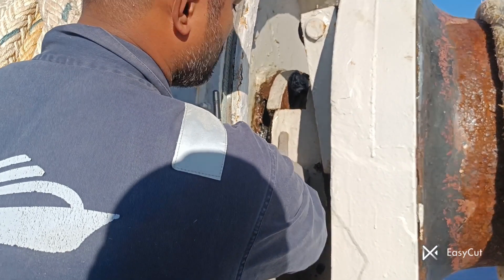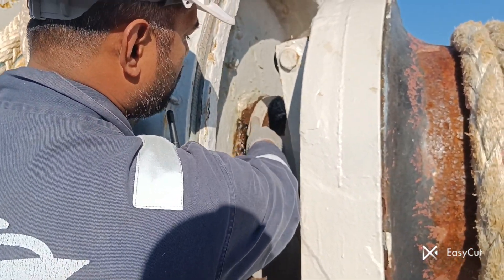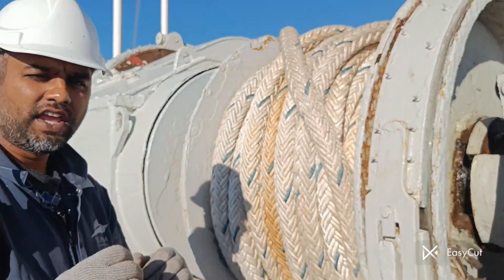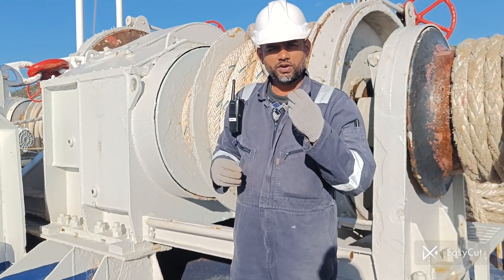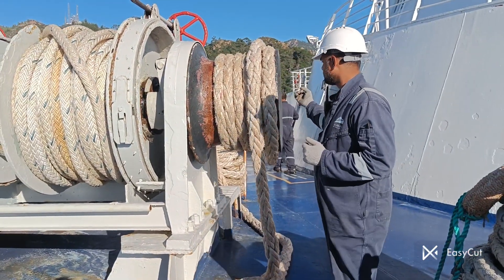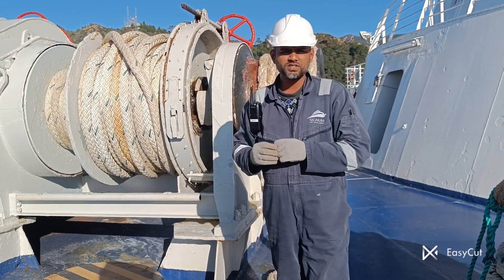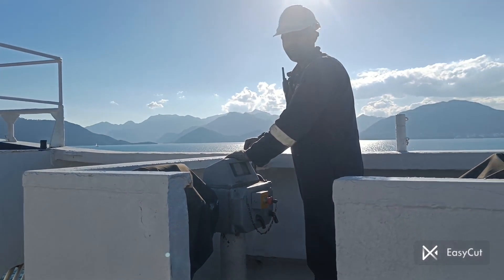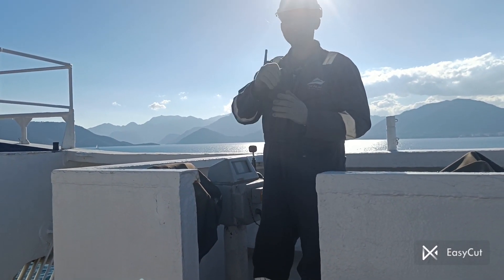This is the clutch for the mooring winch drum. We have two clutches on this vessel — one for the anchor and one for the mooring winch. We use this clutch to engage or disengage the anchor by checking the inclination of the clutch. Because the ship is 43 years old, it is very difficult to visually confirm anchor engage or disengage. On newer ships, even 30-year-old ships, sailors can engage or disengage by themselves, but on our old ship we must always communicate with the winch man. One person always stands by near the winch because we have no power supply system in the winch area.